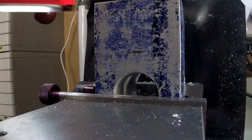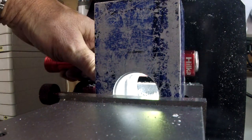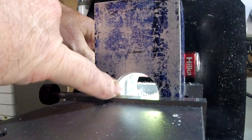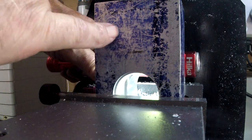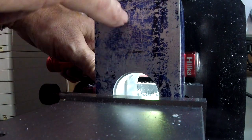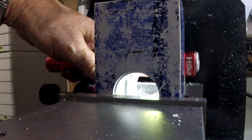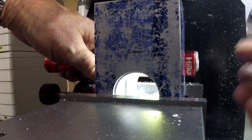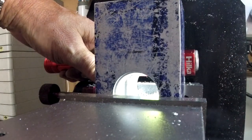So can you see, we've got a chamber there, and we've got one on the other side. I've just got to break the middle bit out, and hopefully that'll create a channel across, so the water can go down there, and as the water warms, it'll rise, and hopefully the cold water will fall. That's the theory, and you get the thermosiphon. So I don't want to go too deep, so I'm going to leave some meat on the bottom for fixings, etc.